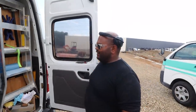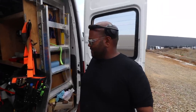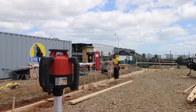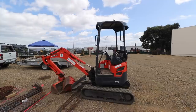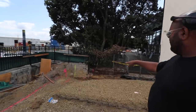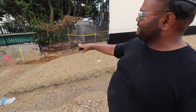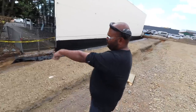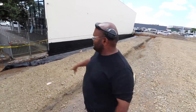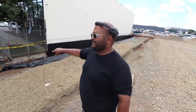Cameron, it's been a while since you've been in the videos — what, three or four months? What are you up to here? Big warehouse job — I'll show you around. There's a healthy setup there; someone tried to steal that one. Some guys stole it, trailer and everything. Check out the footing over there — that's actually 2.4 meters deep from the FFL. It's going to be 400mm of footing, then tilt panels going up eight meters, and that tilt panel gets supported over here onto this footing because there's a sewer line running right underneath it. Are you happy to finally be getting into it? One year waiting — that's crazy.